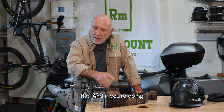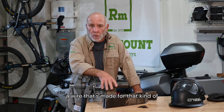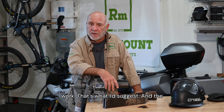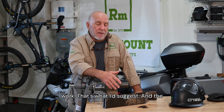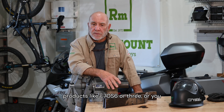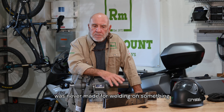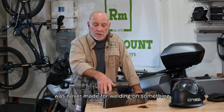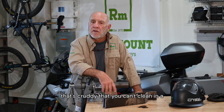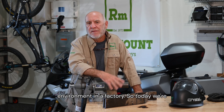If you're doing maintenance welding, you should be using a wire that's made for that kind of work. General purpose welding products like E70S6 or E70S3 — the basic stuff that you see around — was never made for welding on something that's cruddy that you can't clean, in a bad environment. It was made for a clean environment in a factory.